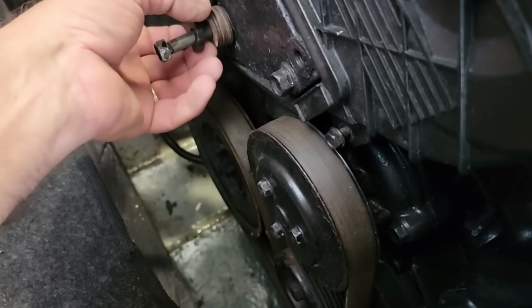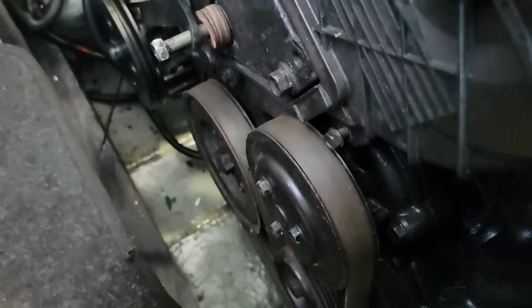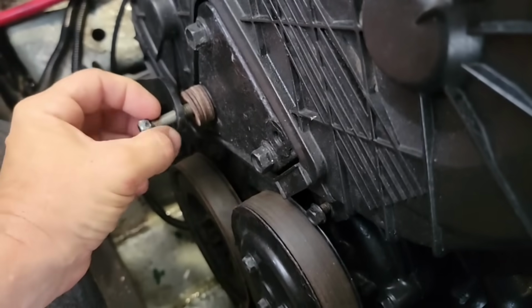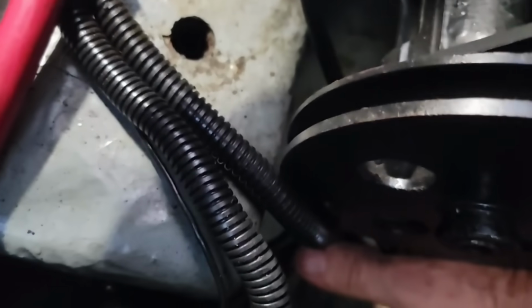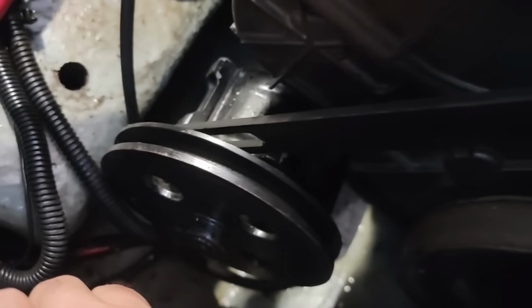I think I'm putting maybe three more washers on there, and that should space it pretty good. And I'll put one on the outside right here as well. It all worked out great. Now I have good clearance. This wiring and the shift cable, I'm going to have to get them tied over out of the way, but I'm definitely clearing the stringer here now. And maybe down in there I have about a half inch clearance now, which is what I like.